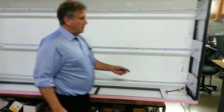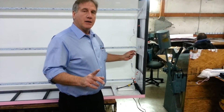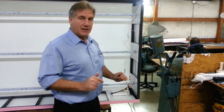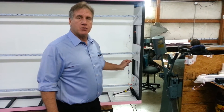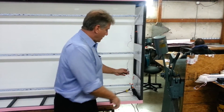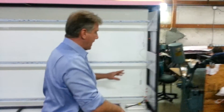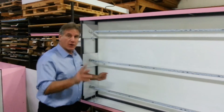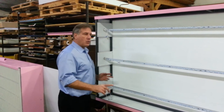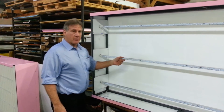The fourth whip goes to the second light rod, but in this situation — because it's three light rods on the 200-watt LED driver — we're only going to illuminate one side of it. So we take this fourth whip and connect it to number two. As you can see, the third and fourth whips are not connected together, because channel one is lighting up rod one and the front side of rod two.